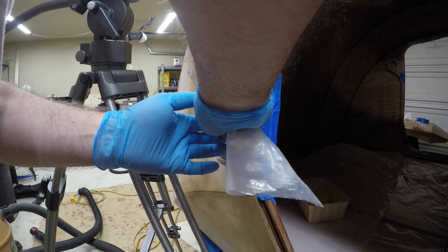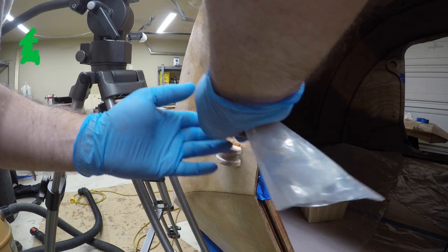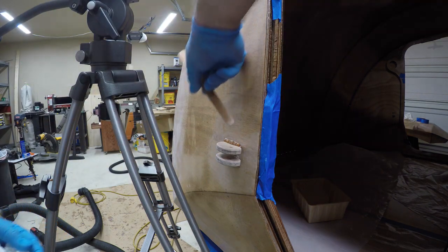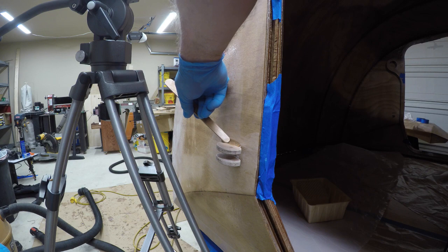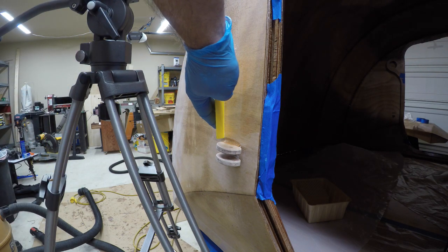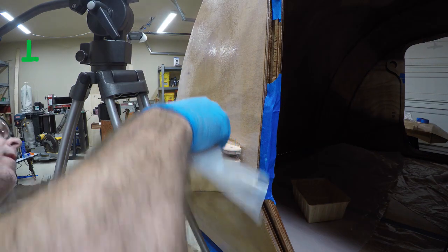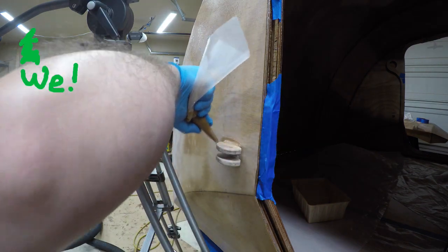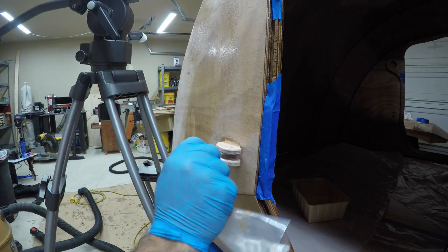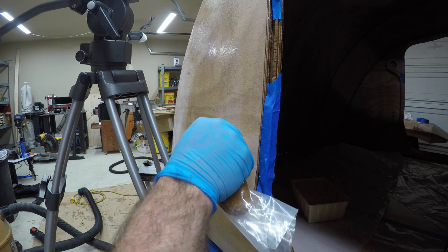After the epoxy was cured, I took the hinges apart and took the galley hatch off the camper so I could do the little fillets on the hinges. These fillets are made with epoxy thickened with wood flour like the other fillets on the camper. Getting in between the hinges for the galley hatch was challenging, but I did fillets in between them and also the door hinges, which are narrower and nigh impossible to fillet in between. This required a cut down popsicle stick.